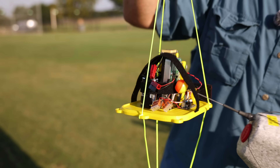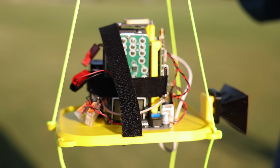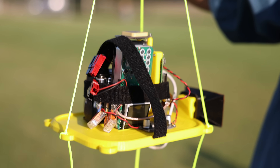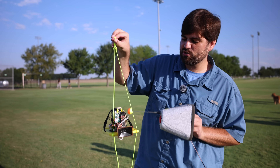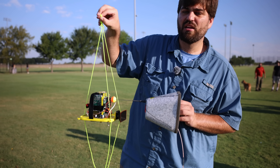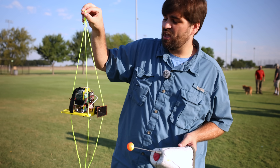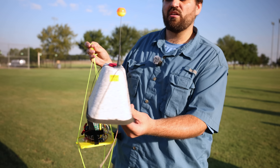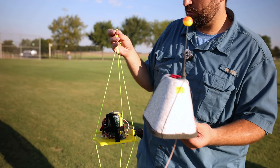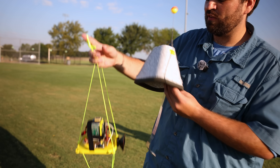Over on this side of the payload is a Quansheng UVK6. I took it out of its case to save space and weight, but that's for Slow Scan TV. Collectively this is sending digital images down — this is the Pi hat, actually a LoRa radio on the Pi, but we're not running LoRa mode, just FSK. Over on the Quansheng, it's just analog FM. On the lid you can see the digital radio antenna — it's a UHF antenna connecting to the digital side of the payload.